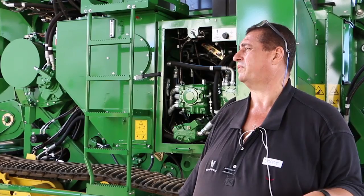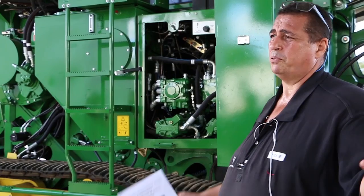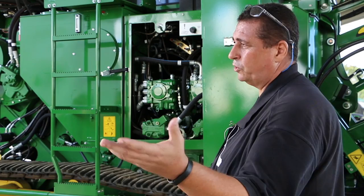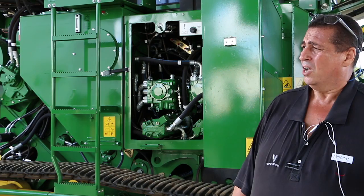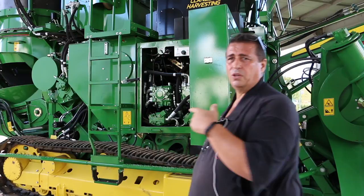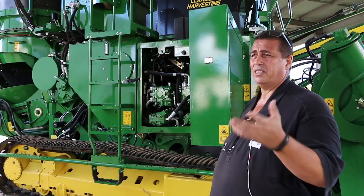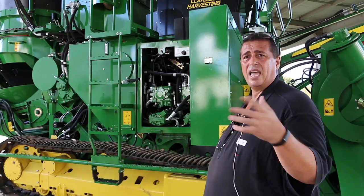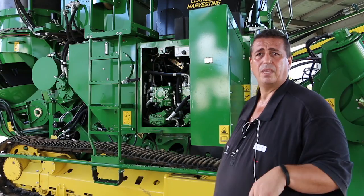Today we're going to show you over the new machines that have come in for 2015. I'm not going to bore you with heaps of pressures — I will show you an overview of what each pump does, so if you have any issues you can check in there first to see if there are loose hoses or whatever else may be the cause. We'll also show you some differences between this machine and the ones you own now. In particular, the service intervals on your rear drive hubs are now 100 hours — they used to be 250, but they're now recommended from the factory at 100-hour service intervals. They are a different setup to some of the older hubs in the other harvesters, and that's why John Deere have said we have to change the service intervals on them.